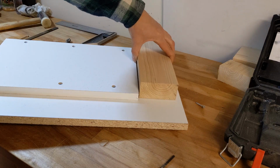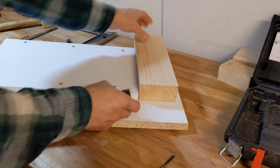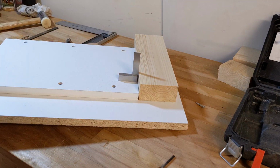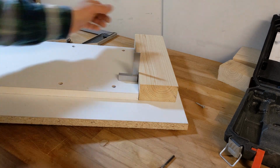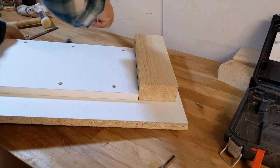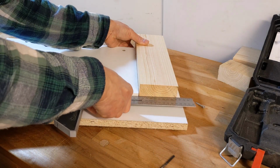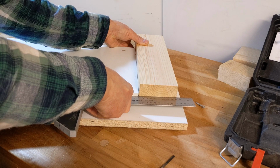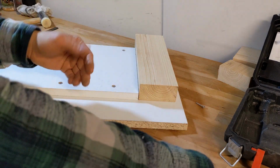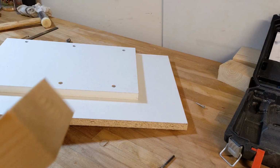So we're now accurate where it counts. We can rest that one down accurately and it's nice and flat. And when we check it with a square, it's nice and square, so I know I'm getting what I need. We also want to make sure that this end is nicely prepared now. It's much easier to do it now and to get it right. All we need to do now is really clean up that end grain, because I made an effort to obviously cut it square like we all do. It's only going to take a minimal amount to just tidy up that end.